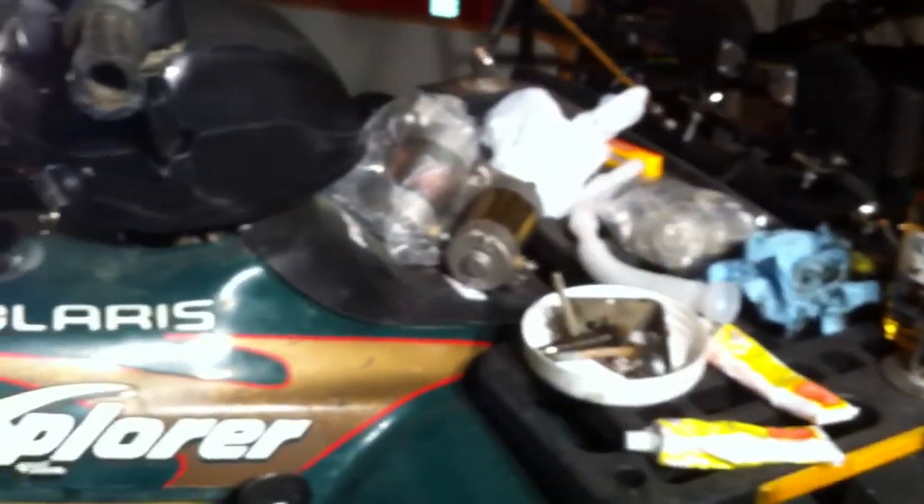What's with this side — is this the starting? Yeah, that's the old one. Still spins over fine, it just hit dead spots where I had to smack it. The brushes were sticking. Are you going to rebuild it or get a new one? Look right beside where you just grabbed it — there's a brand new one right there in the bag. It's a Chinese starter. There's like 15 seals and 20 bearings in that front wheel kit, because this one has a little bit of play starting. More than a little bit. This is my center link on my Caprice — I went and put it up on the lift and changed it out at my buddy's shop. It's got this much play between the pitman arm and the center link. Luckily when I had my old Impala, when I bought it and it was safetied, it got a brand new one on it. So I saved that when I wrecked it, and now I got a free center link.